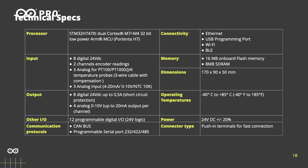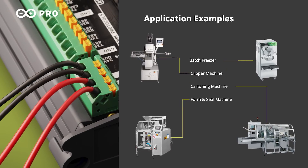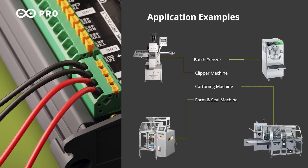Let's talk about technical specifications. The heart of the Portenta Machine Control is the Portenta H7. The board has a lot of inputs and outputs to be used for connecting existing machineries. It has digital readings such as encoder and analog inputs for temperature probes PT-100 and PT-1000. Analog inputs for 20mA and a lot of outputs, either digital or analog, that can be used to drive external equipment. Push terminals for fast connectors allow easy and fast implementation in your existing product.